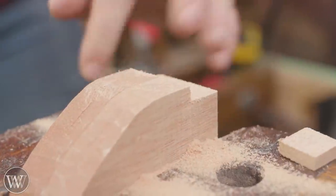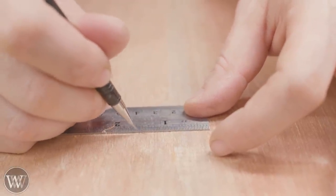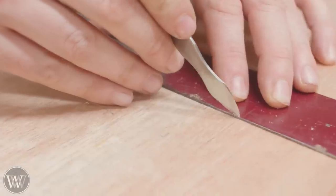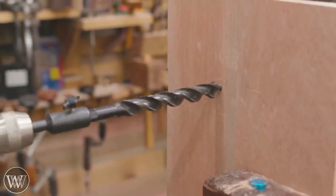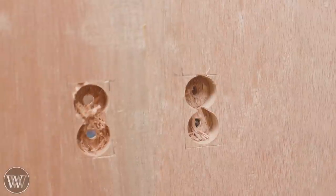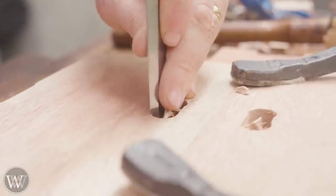I had to come back and clean up a little bit — there's always some fuzz in there. A good sharp clean cross-grain cut — very pleasing to get that tiny little wisp out of the corner. Now we're going to lay out where we want these to be. I didn't have the flashlight on hand so I had to go by measurements that were sent to me, and the measurements ended up ever so slightly too close together. The flashlight didn't sit just the way I wanted but it came out pretty close. We're going to lay them out and mark them with a knife. I want this to be very accurate. I'm going to mark the front side and drill from the front through until the bit just pokes out, then turn around and come from the other side — that'll give me a clean exit wound on both sides.